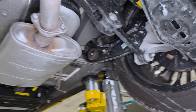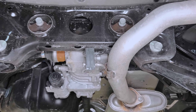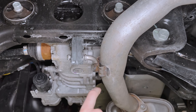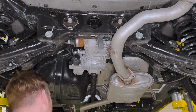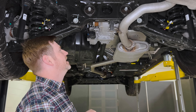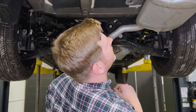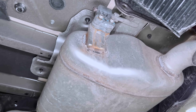If Chris Fox were here, he'd love to talk about the exhaust strategy. Nothing too novel, but they are using hollow tubes — and there are some welding considerations as far as tube thickness and materials. They do an intermediate bracket; sometimes you can get away with going straight to tube, but hollow tubes are lighter, and it's something the Pacific OEMs like to do quite a bit. They're doing solid hangers on the vehicle itself with an interfacing bracket.